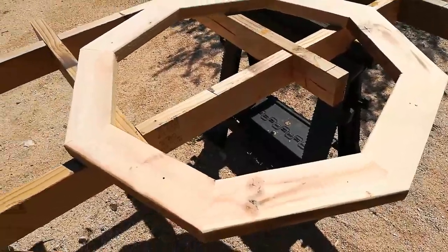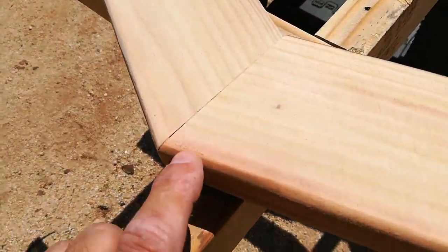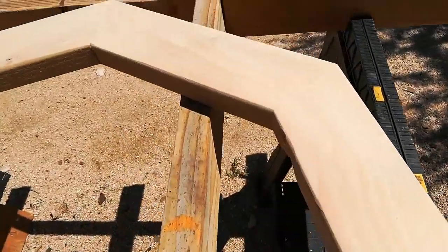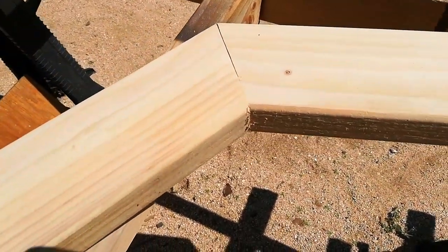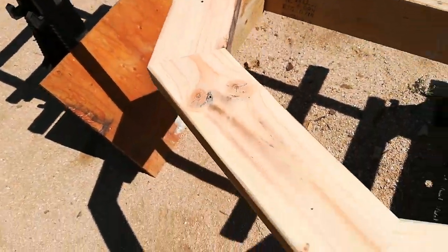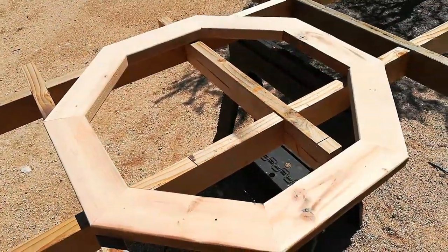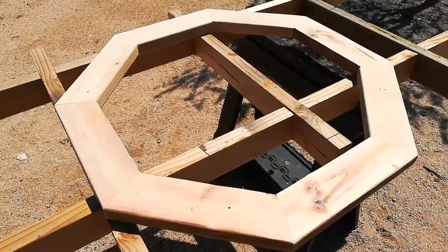The glue dried and I hit this with a belt sander using 120-grit just to make sure all the seams were nice and smooth, then went over it with a palm sander at 180-grit. It was kind of fun because the miters turned out real nice and tight, and the pocket screws are holding it together really nicely. Now I just need to figure out how I want to finish it — I can't decide between shou sugi ban or just hitting it with some dark stain and polyurethane.